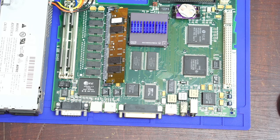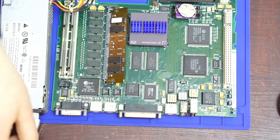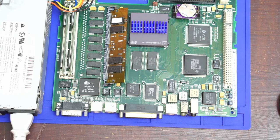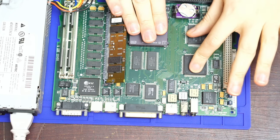Now, what's interesting is one of the classic debugging steps on a vintage computer is you go and feel for what's hot. I put a couple little heat sinks on the CPU because now we're running without a fan and all that stuff. So now everything's on, but we can't tell it's on. You start feeling things, and the CPU's feeling a little warm.